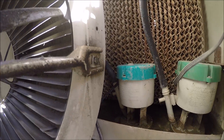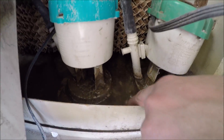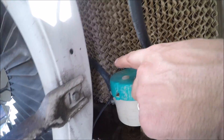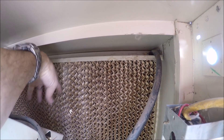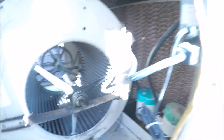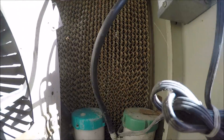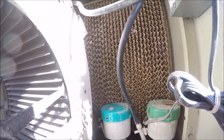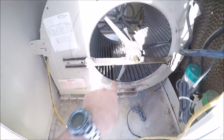There are two pumps in this one. These water pumps suck water up out of this reservoir, up these tubes. There's a tube here and a tube back over there, and they dump it all up into a tray up here, and the water trickles down through and saturates this thing — it's really, really wet. But this squirrel fan here spins, sucks air through here, picks up that moisture, cools the air, and then pushes it down into the house.